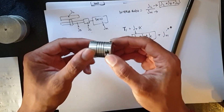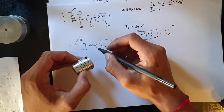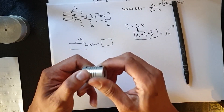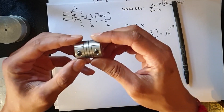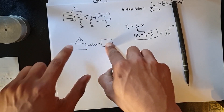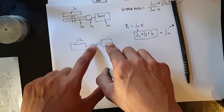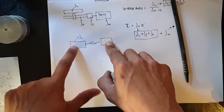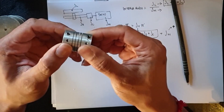To combat that, it's preferable to have a stiff system. Modern servo drives can accommodate things like this using advanced control algorithms, but with a basic servo drive you don't have access to those. The best solution is to increase the stiffness of the coupling between the servo motor and the actual system — and by stiffness I mean everything: the coupling, the housing, the stages — everything that rigidly connects that motor to the load side.